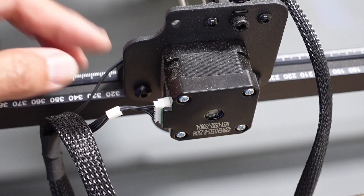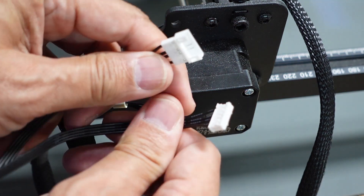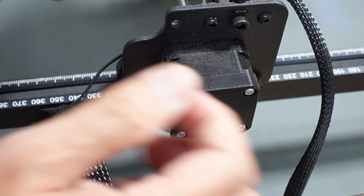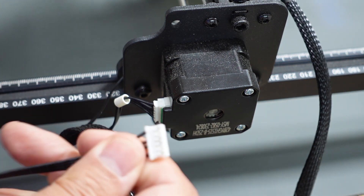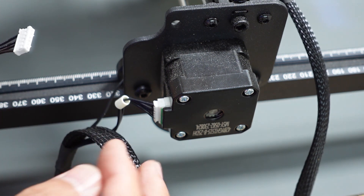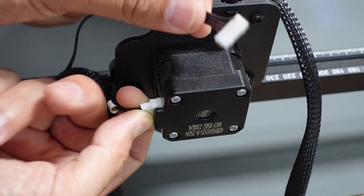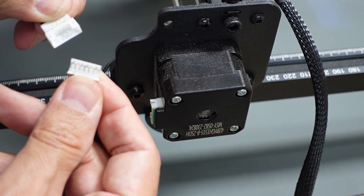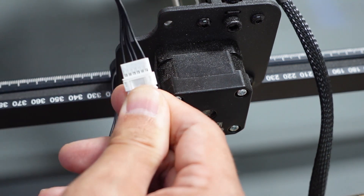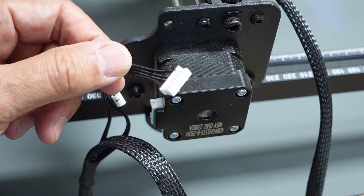The laser has a connection on the Y-axis. The rollers come with a spare cable, but it wasn't clear which electrical cable attaches to the roller — you really have to read the instructions. It tells you that you have to disconnect the Y-axis cable, then connect it to this extension cable, and take the other end of the extension cable and plug it into the roller.